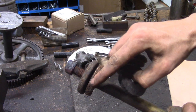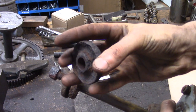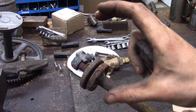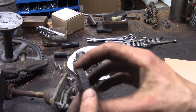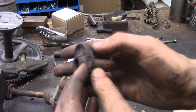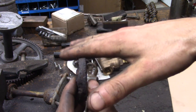This seal disc and the other one — I guess these are more like seal support discs. The actual seal is leather. It's a cup-shaped piece of leather formed around this. It's cup-shaped because when you have pressure on the inside of that cup it's going to swell the cup out a little bit into the bore of the cylinder and create a good seal. The original leather seals were just totally trash — bend them and they fall apart into little brittle pieces. We need to make new ones, and you can't just cut a flat piece of leather and stuff it in there because you need to form it into a cup shape.